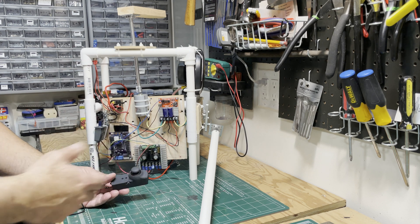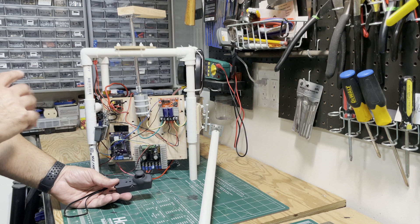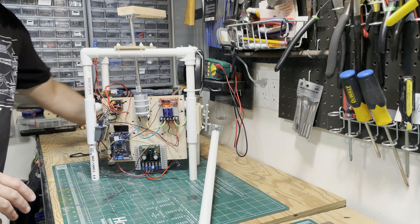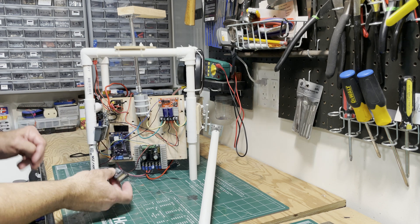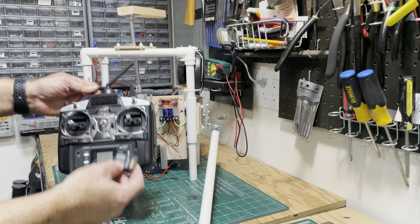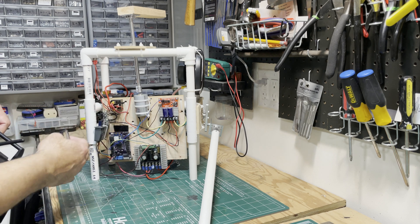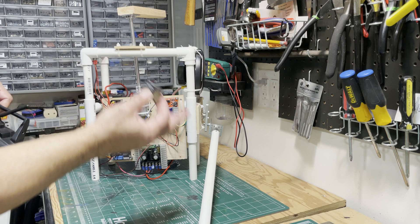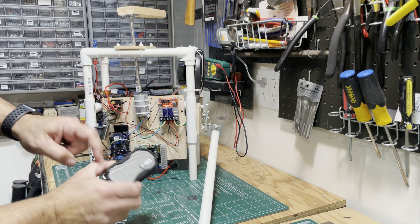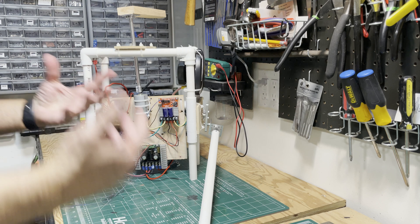This remote is connected to this board right here. It's a little pricey but it's called a stealth controller - it was made for the R2 builders group for people who wanted to control R2D2 stealthily. I'll put a link in the description for where you can get that. This could also be controlled by something simple like a standard RC receiver with a standard radio to do basically the exact same thing. The nice thing about this board is it has sound on board, so from that same small remote I can trigger sound effects. With a standard RC receiver you won't be able to do that, but you could solve that with a Bluetooth speaker and an app on your phone.